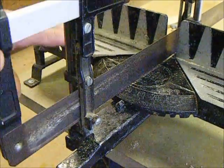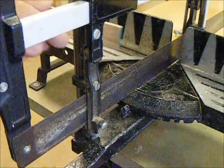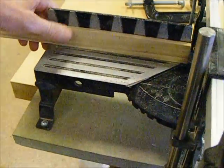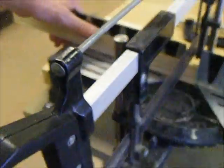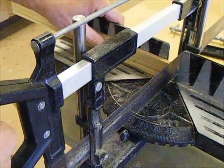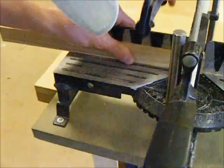This time I want it at 90 degrees, so I'm going to leave it like that. I'm going to hold my piece of wood on the left side there, so that the saw will be cutting it like that. I'll hold that in place with a clamp — slide it along where I want the cut to be and hold it in place.